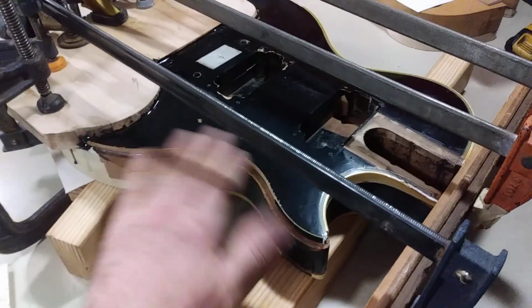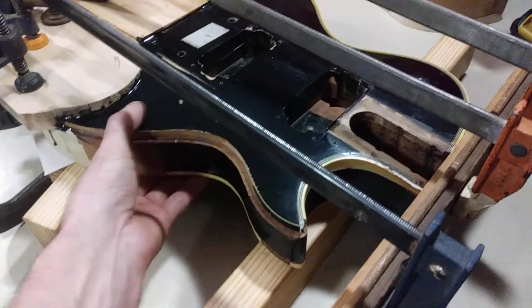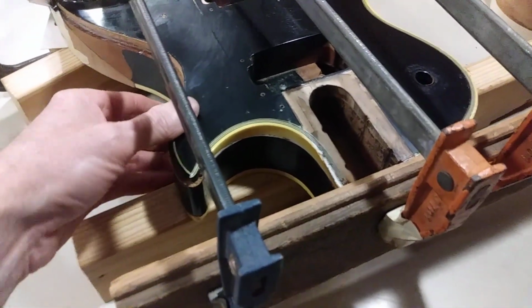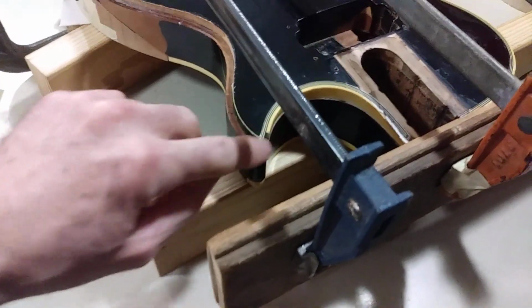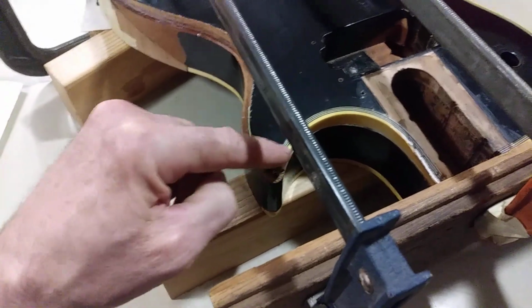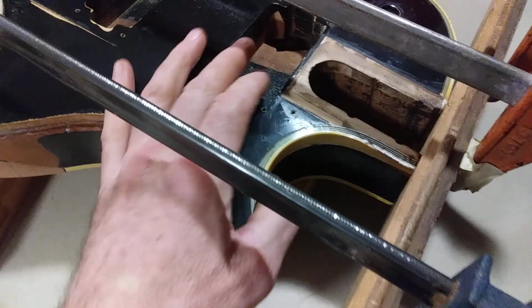You remember in one of the first videos I said, at a minimum, I know I'm going to drop this lower plank off. Well, look what happened within 2 or 3 videos. I decided, let's just leave it on. It's fine. I didn't encroach on the original join here between the center plank and the lower plank. I didn't have to remove any of this binding, and even though this is banged up really bad here on the corner, I'm not going to be arrogant, but I know my abilities with binding work. I can fix that. I can join to that damaged area, and you'll barely even know, even with a magnifying glass, that I've made that repair. And it allows us to keep all this original stuff in place.